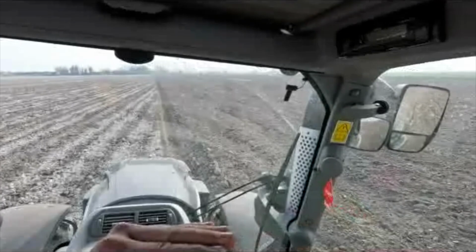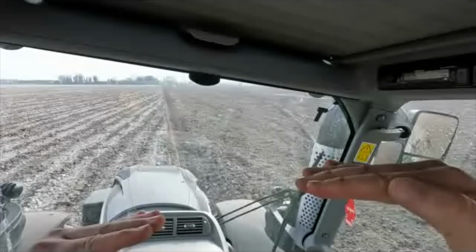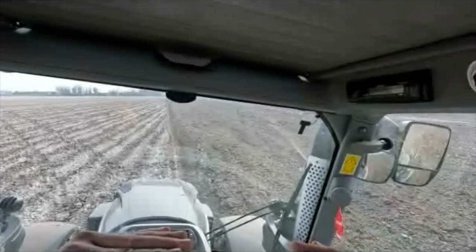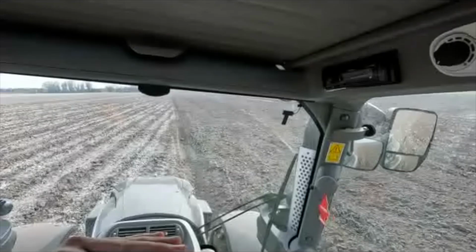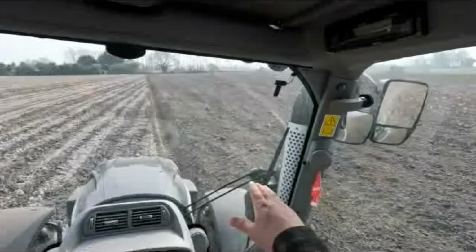So you've got a draft control. You can either have it so the tractor holds the implement solid like that, and won't let it move up and down so it goes with the tractor. Or you can have it so the implement floats up and down. So if you're going over a dip and a bump and a dip and a bump with a power harrow or a cultivator, the cultivator doesn't come out of the ground when the tractor goes over a dip, and then it doesn't dive itself right in. So the draft control just lets whatever float around, and you can adjust that so you can have a little bit or you can have a lot, you know? Exaggerate it a bit. Yeah, you can see where it's dipping and diving. It's leaving a little bit of a hole there, so...